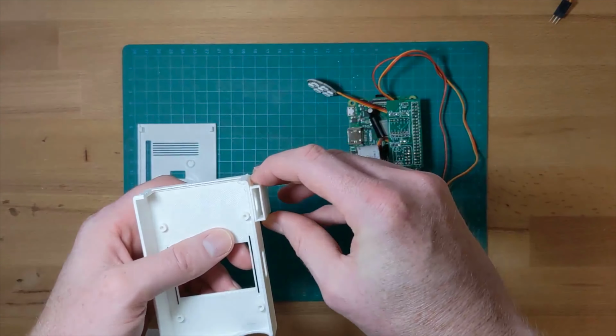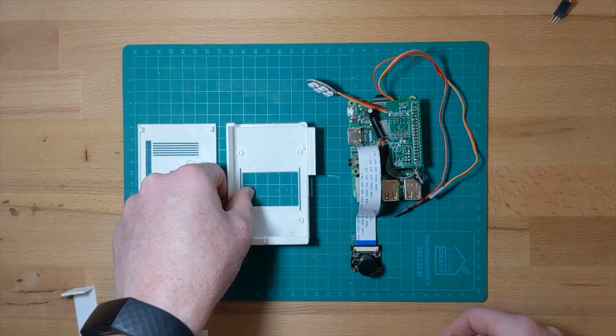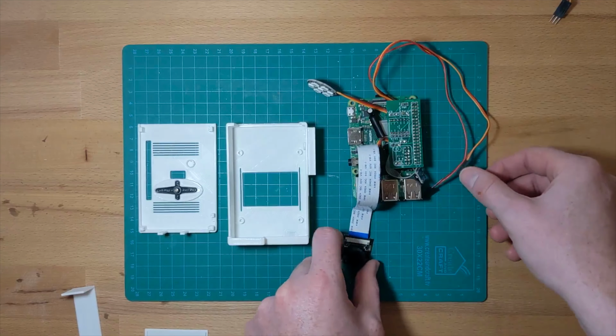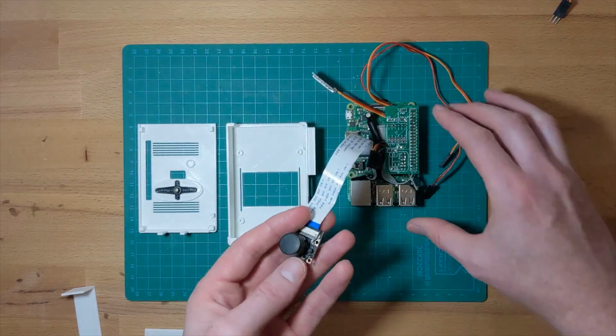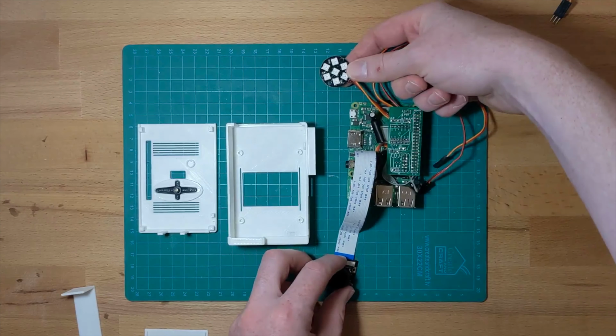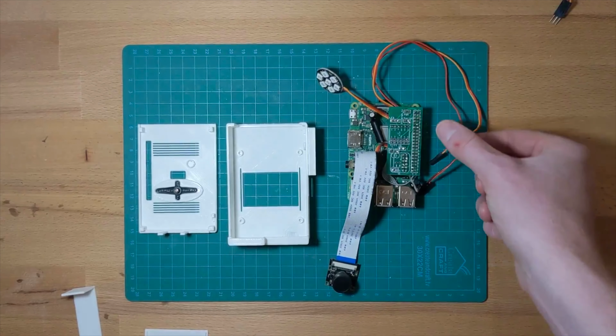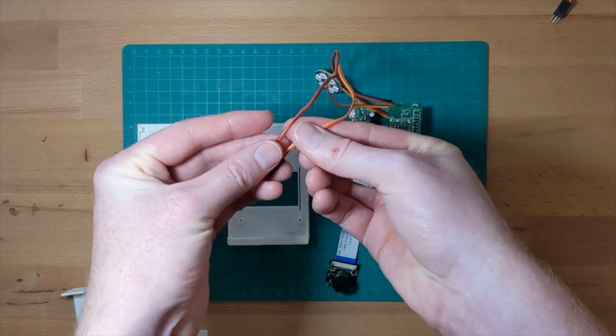The head is also PLA and contains a Raspberry Pi with a custom PCB. As you can see, we have the camera attached to the CSI port. It has a 160-degree field of view, and it has a small array of neopixels for the RGB output. The cables are to connect the Pi to the body PCB for power and serial communication.